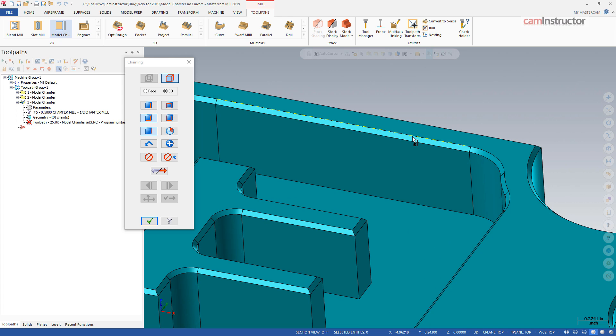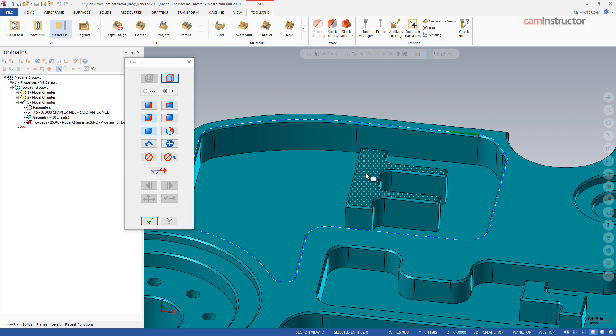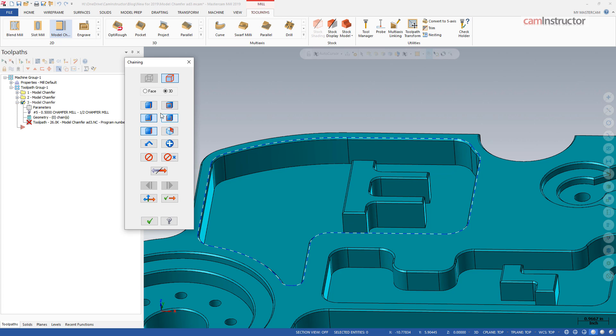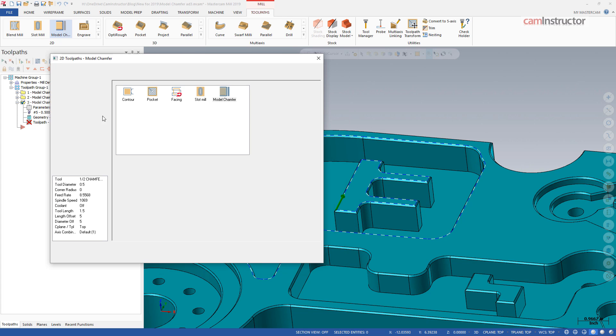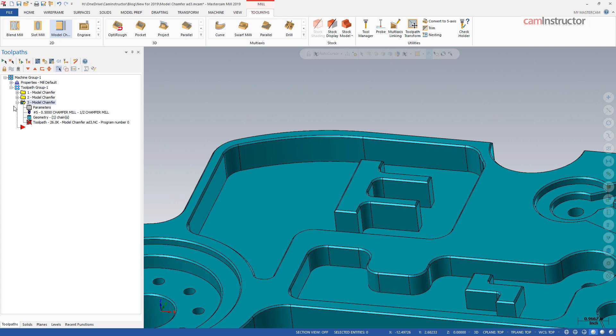The top loop — we'll step around. I got an edge there instead of a loop but that's okay. We'll come in and do this top face here as well. Since we grab the top edge of the chamfer and we already have a chamfer, we do not want to specify a chamfer width. Since we grabbed the top edge we need to do a top offset — this will make a gap from the top edge we selected to the actual top cutting edge of our part. I'm going to say an eighth of an inch. Everything else will remain the same and I will rebuild.